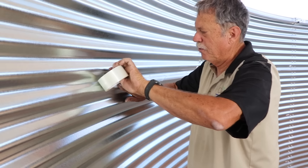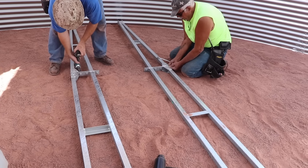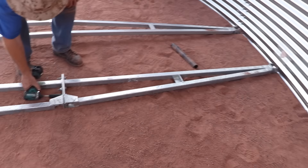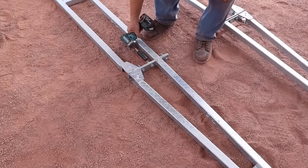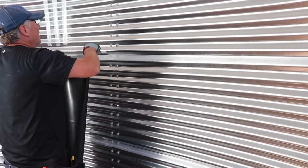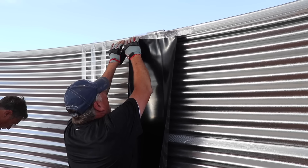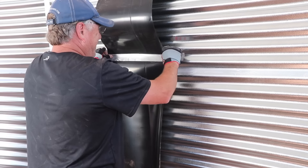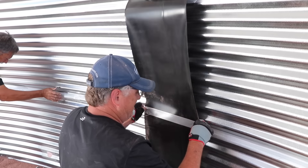The roof trusses are assembled on site. For this size of tank it's just three separate pieces bolted together, and the ends screw into that top two-inch curved steel piece. John is attaching some membrane across those bolts so that when the liner is in there, it's not rubbing against those carriage bolts — just an extra level of protection for the liner.